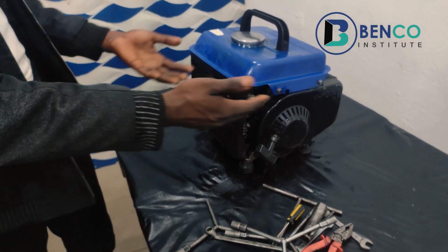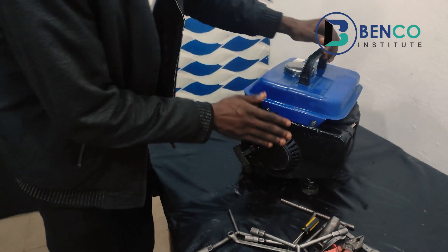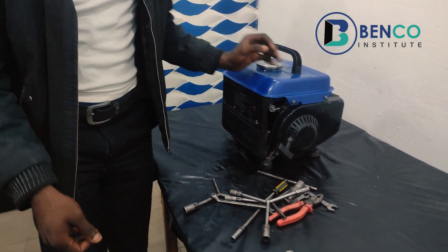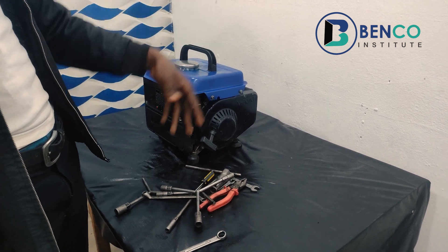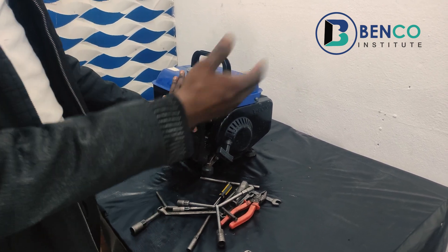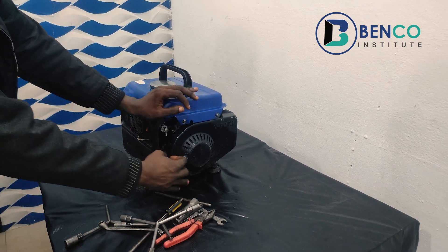As a non-technician, he feels there is just fuel under the generator, but for us we believe the carburetor overflows — fuel gets into the carburetor and comes out even while it's not supposed to happen. So what are we going to do? Let me just put on the generator so you have an idea of what we're talking about, although I did drain out the fuel from the carburetor before putting this on the table so that the generator will be easy to start.